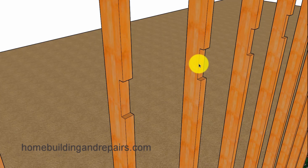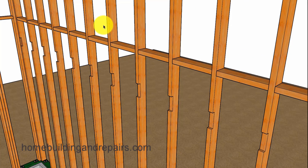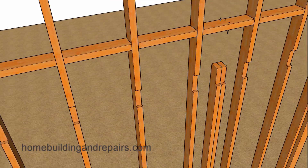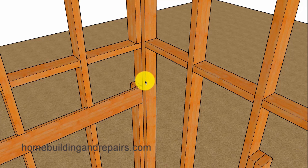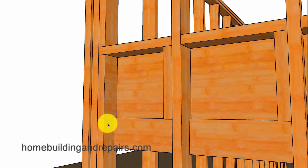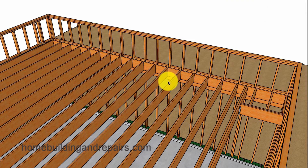If you have a concern that this is going to weaken the wall framing studs, then you can always go to larger wall framing studs like two by six. This is actually one of the methods carpenters used years ago when balloon framing walls, instead of platform framing like we use today. You could notch for the ribbon and have the joist connect to the wall framing stud — sitting on top of the ribbon but nailed into the wall framing stud. I have only built something like this once in a commercial building, and I'm not 100% sure it's going to provide the best option for transferring the weight from the joist down to the building foundation.